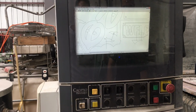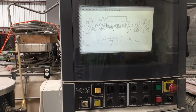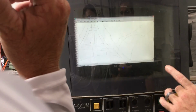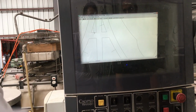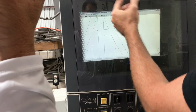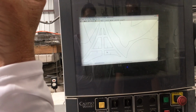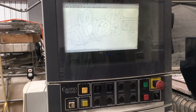That's pretty neat. Cool. And how do you know that you have everything mapped? Because I'll literally see every single one will be positioned. Like I would never do that. In fact, I wouldn't even shorten that up. I would put that one here. Okay. And then I would center it up so that my lead-in point is actually in the middle. And that's a long lead-in. I would probably go half that. But again, you just position everything where you want it. And once you do this once, that's it. I got this file. Because now it's saved in console.